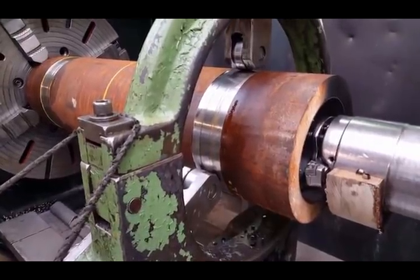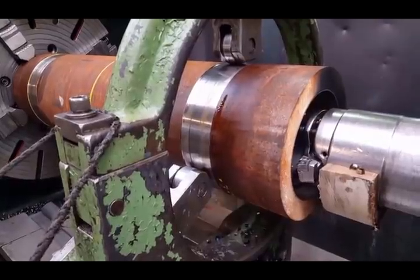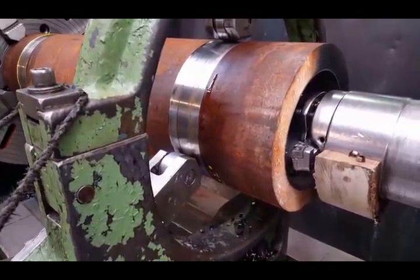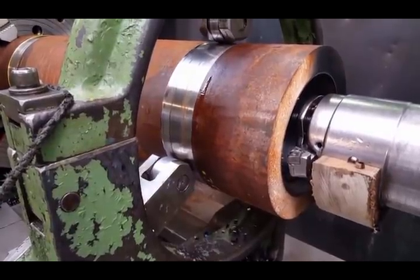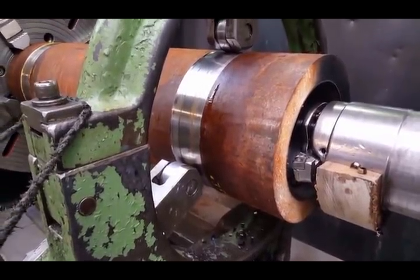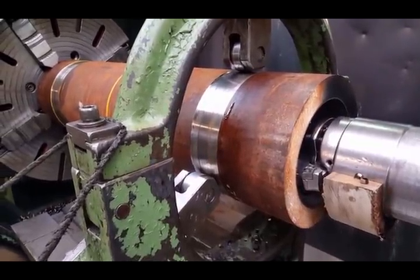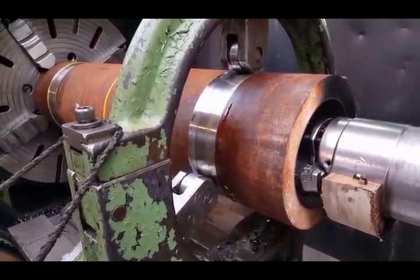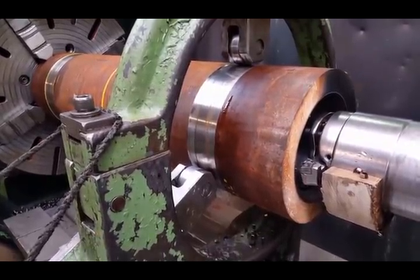This steel is 4130, 50 inches long. I'm opening the bore up from 200mm to 220. So I suppose a 40 thou tolerance isn't that bad — but it is to me, and I'm not having it.